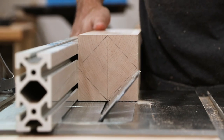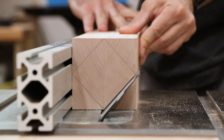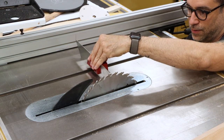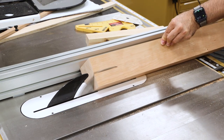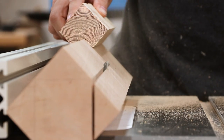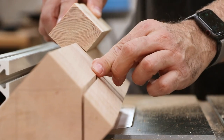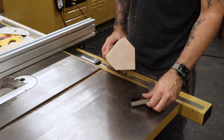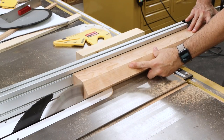This first cut on each piece — we can make adjustments as needed to make sure we are right on our pencil lines. The remaining cuts will be at 90 degrees. With that second cut, we now have our new 90-degree corner. This method yields a hidden glue line as well as beautiful rift grain on all faces.